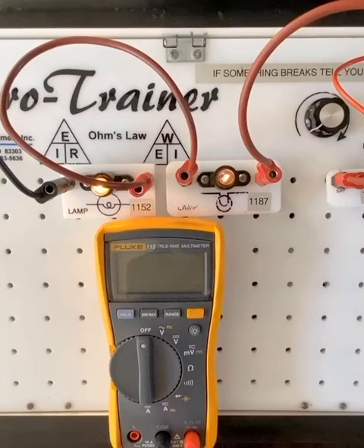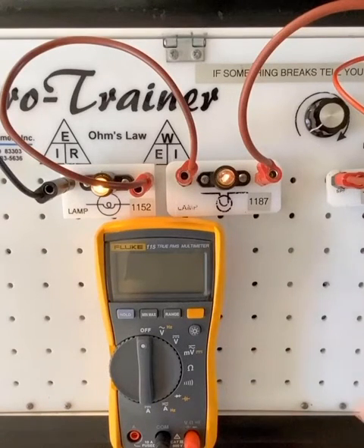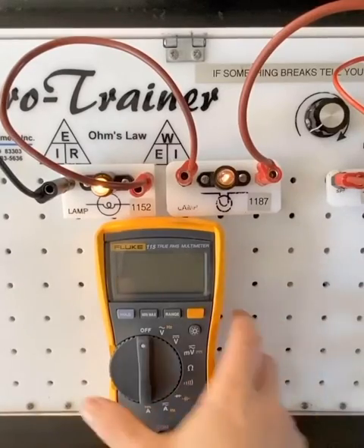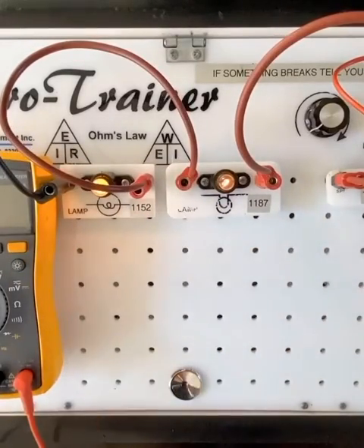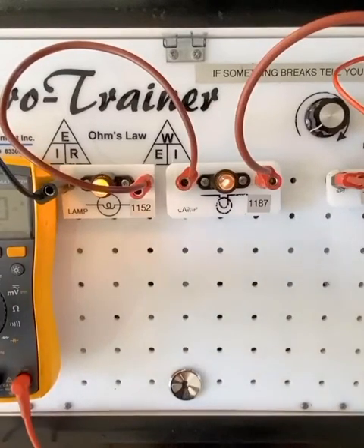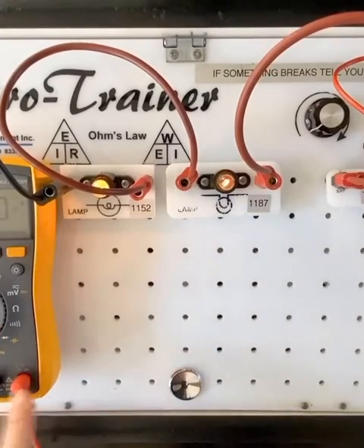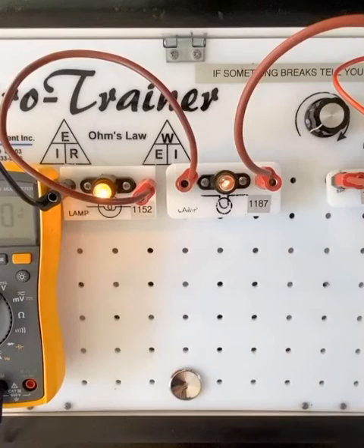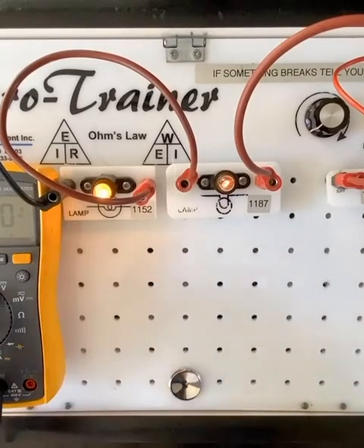On the board, we're looking at amperage testing using the same circuits from our voltage testing, but hooked up differently. Right off the bat, when I try to measure amps, the meter beeped at me — it's saying 'hey, you're in the wrong hole.' If I hooked this meter up across the power source right now, I'd pop the fuse inside because there's no resistance between the terminals — I'd simply be creating a short circuit.